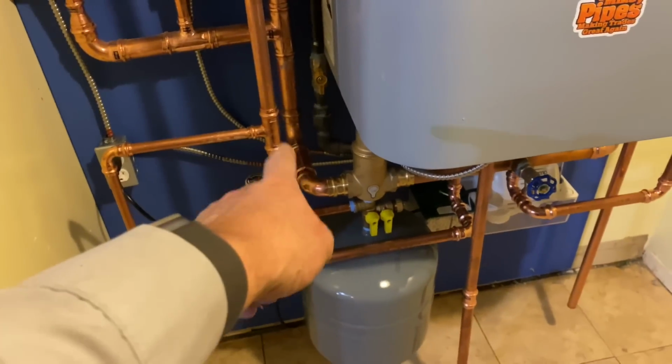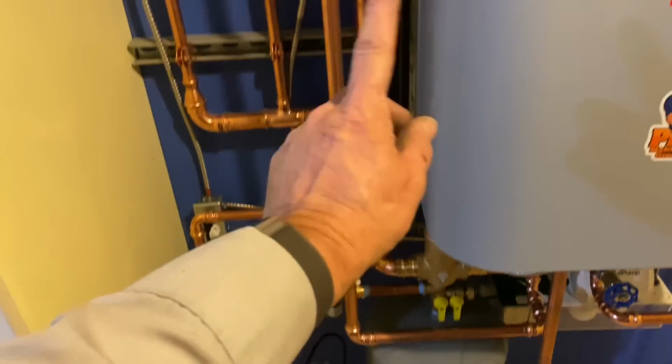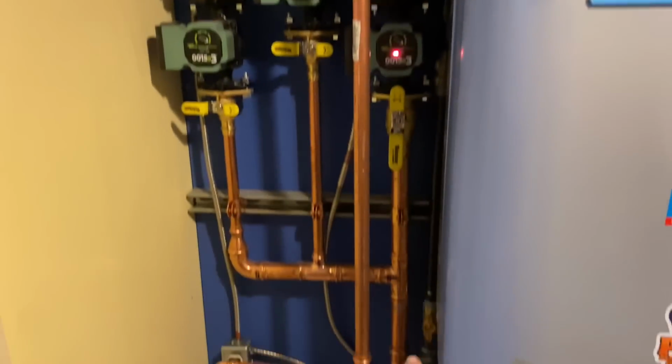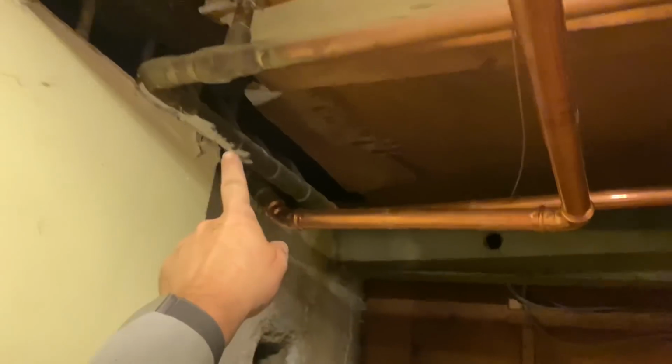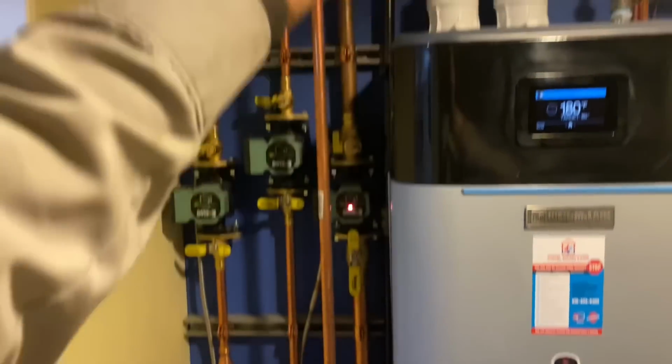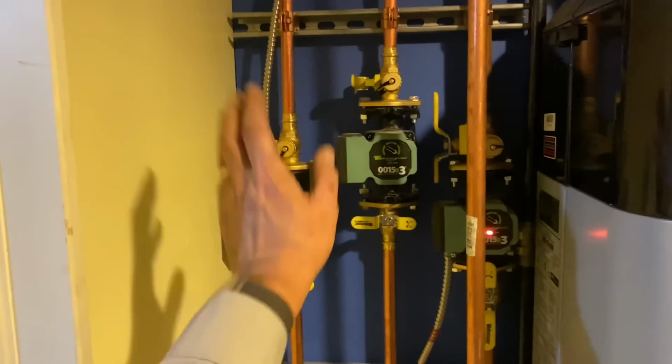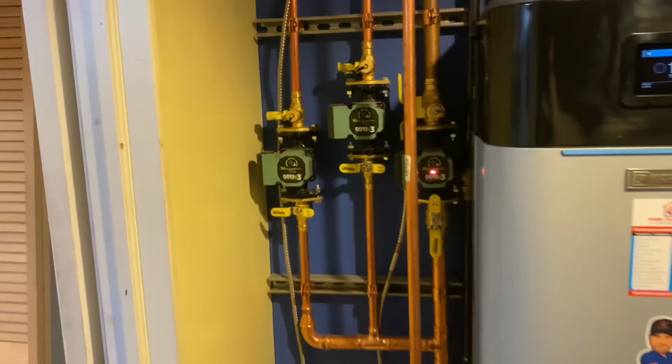So we got a street elbow going right into that spiral vent, coming up with the T, a full 1.25 inch T, picking up that main zone, because we thought it was all 1.25 inches, but it's actually all 1 inch. But nonetheless, we used 1.25 inch leaving, and we have 2 future zones, 2 and 3, reserved for future use.